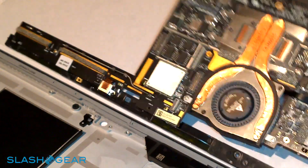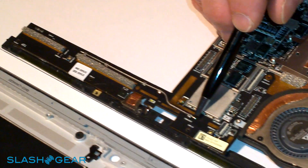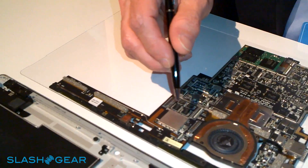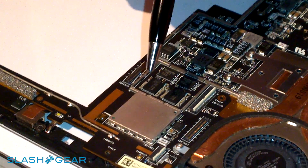If we look on the opposite side, you'll see a coax that runs from this side of the radio to the second antenna. This is one of the few products where we've integrated the antenna system and the radio together on one motherboard to save space. Underneath this lid is a controller chip that manages the battery and the cooling system, and we have special code that runs just for that purpose.